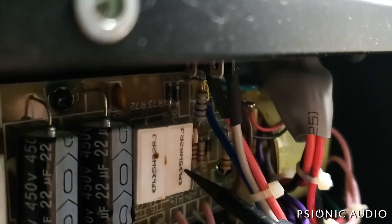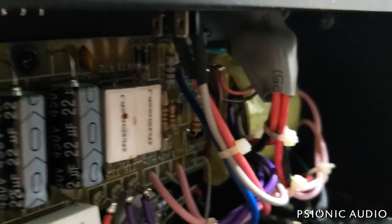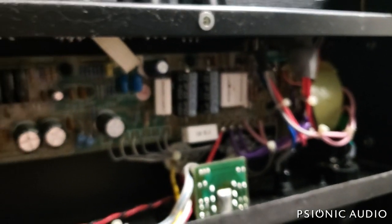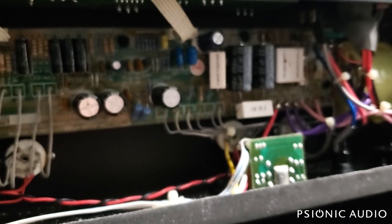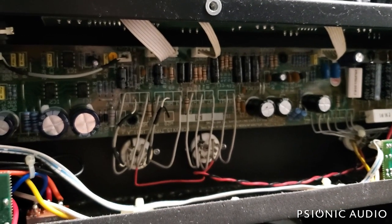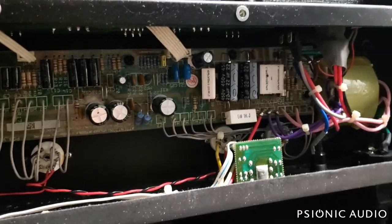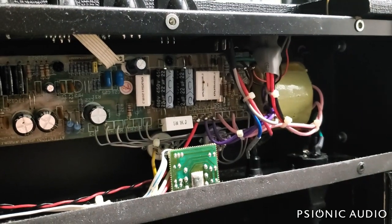Using my meter to measure diodes — this one measures fine, but this one has gone the way of all flesh. Diodes are very inexpensive and relatively easy to change, even on this model. It does involve removing all the pots and jacks and a lot of screws and carefully pulling the board down. About a 5-cent part is causing all the problems.